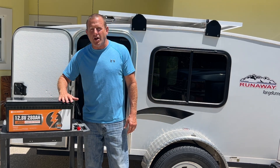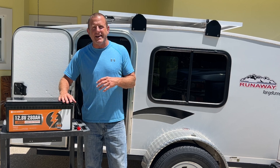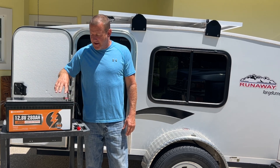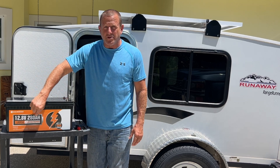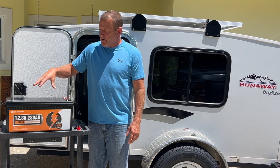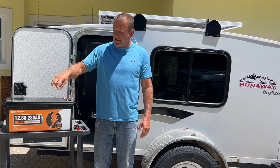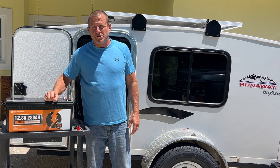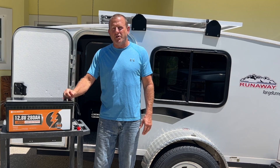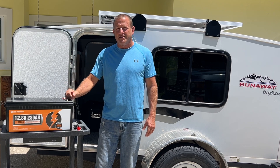That's definitely going to give us plenty of power to run the AC all night, even during the day. We're going to do a capacity test on this to make sure that the label is correct — really important on batteries to do these capacity tests — to make sure it actually holds 280 amp hours. Then we're going to remove the old battery and install the eco-worthy.